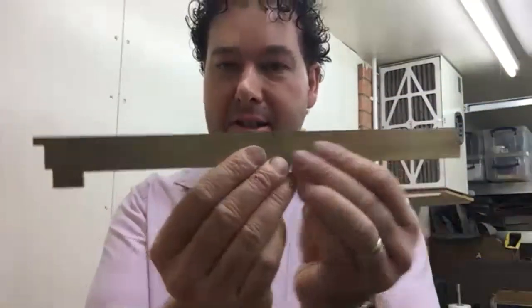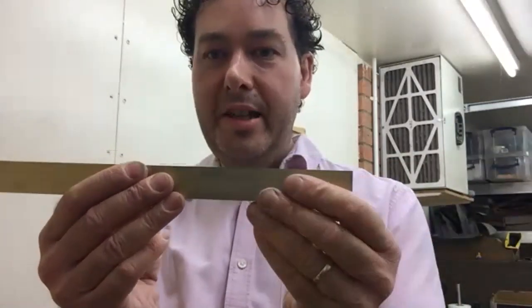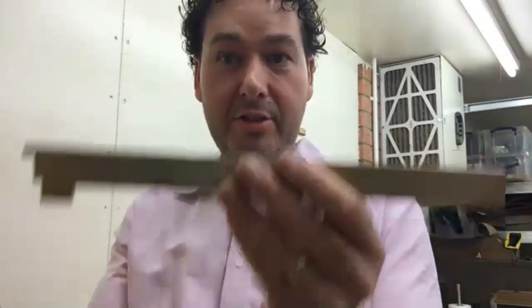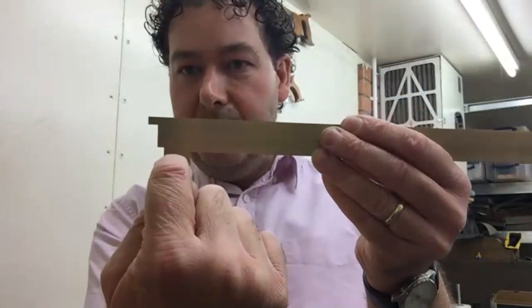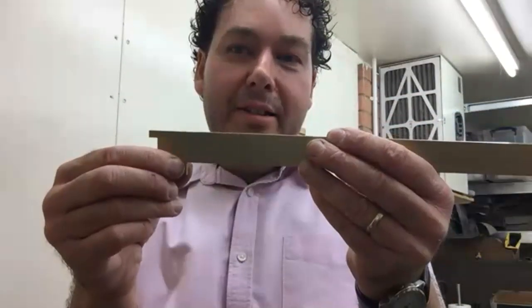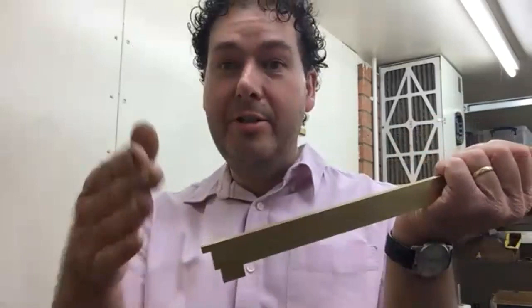Now, this is squashed, which grips the blade just the same as a folded back does, but the blade is pinned at the front. It's then pulled as it's knocked into the back. So the blade's actually made slightly curved as it goes into the back. So this back is trying to pull back straight, pulling on the tooth line. And the front bolt that goes through to assemble the saw actually passes through this lug, through the blade and through the woodwork, which means that the blade can't shake itself loose because it's pinned, which is one of the problems you get with buckling on a folded back, is when the blade, you know, just comes loose and then you end up with a concertina in it.